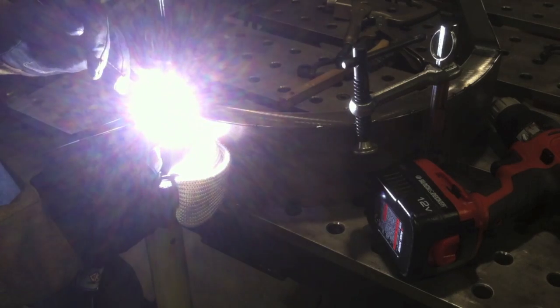The twisted wire is just about like using 1/16th diameter wire, so it really does come in handy if you run out of 1/16th filler metal. This next angle is a bit odd — mainly so I could get the camera shot in there, feeding the wire from a weird angle. Sometimes you just have to do that, but here I just did it to try to get a decent shot.